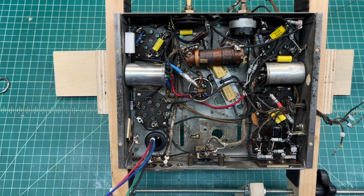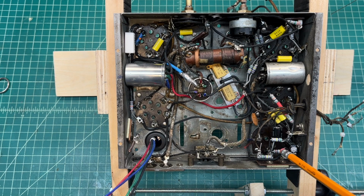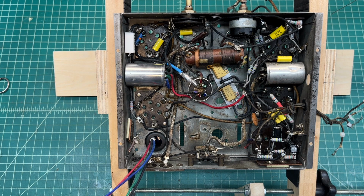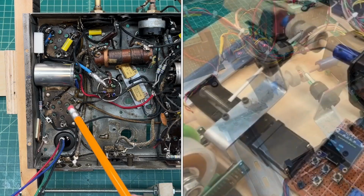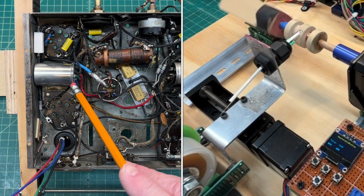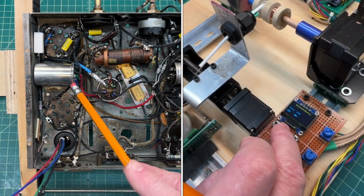Things are a little bit tight down here around the rectifier tube, as you can see, the type 80. So when I tie in the transformer, I'll probably go ahead and tie in the electrolytic capacitors at that same point. The IF transformer back in that I had to rebuild. Do a rewind on that.